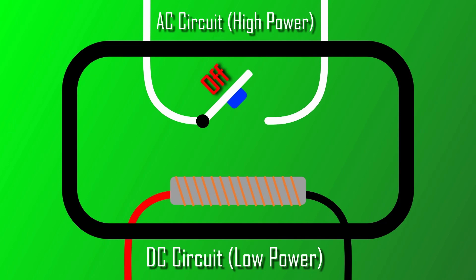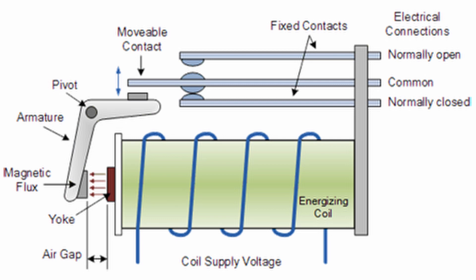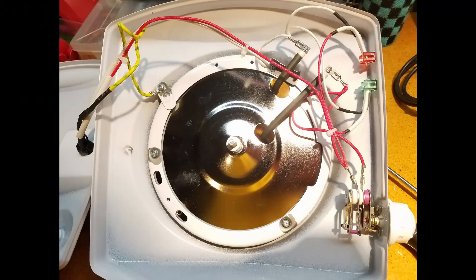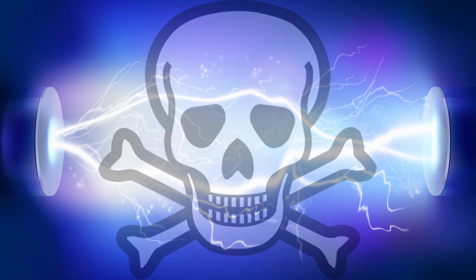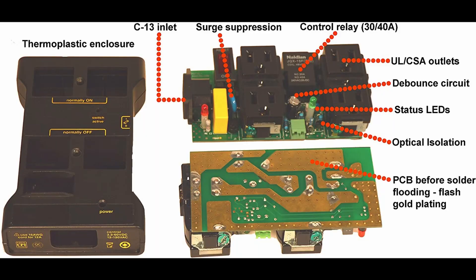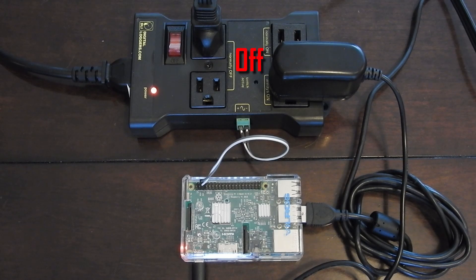The low-power activation circuit is isolated from the high-power circuit on top — this is what makes relays the ideal choice for controlling my electric burner. Real relays are somewhat more complex than the animation, but they still operate on the same principles. Instead of manually wiring a relay inside the burner — since alternating current is very, very dangerous — I bought a switchable plug bar that uses a relay to switch its outlets on or off. Once I connected my Raspberry Pi to the switching plug bar, everything worked great. Whenever the Pi found a face, it triggered the plug bar, which deactivated the burner.